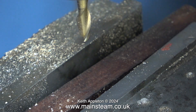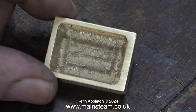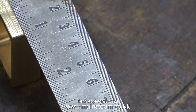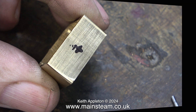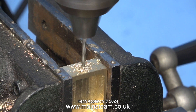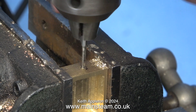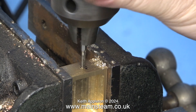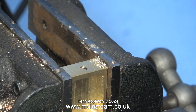This is the job almost complete. What I need to do now is clean up the part, starting with removing the felt-tip pen lines. I was really surprised to find that this brass block is 1.5 inches long by 1 inch wide by 1.5 inches deep — and that's completely without measuring anything. This is the first time I've taken any notice of the graduations on the ruler — it's to mark the position where I'm going to drill a hole, which will be threaded to take the handle. Over to the drilling machine: I'm just carefully spotting the end before drilling all the way through. I have a tapping-size chart on the wall for BA threads. I drilled a 2mm hole as the chart indicated, but threading it went a little too easy for my liking. The first part of the job is done — I have something to screw the handle into.